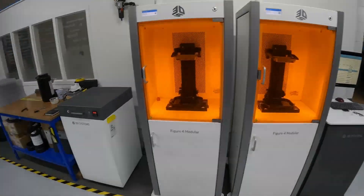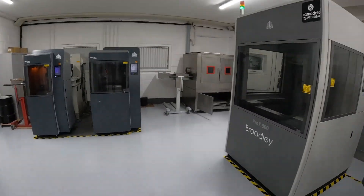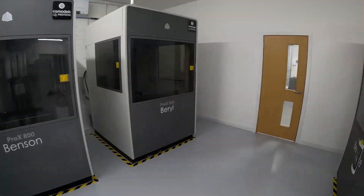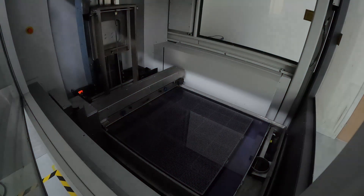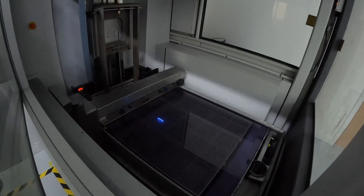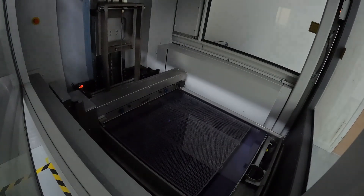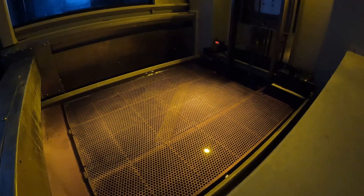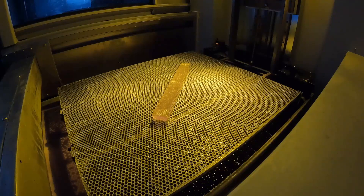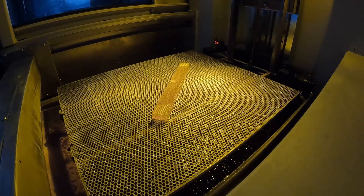I'm lucky enough to work for a company called CE Models, part of ProTotal. This is my department — this is SLA, which is Stereolithography, which uses UV curing lasers. These are all various machines: we've got Pro X800s, iPro 8000s, Pro Jets, and Vipers, and we run various materials in these. From HPC — which is a high performance composite, used by a lot of Formula 1 teams — right through to something like this clear material. This just happened to be running on the day as a wee test piece, so I thought it'd be cool to let you see how the laser works. Basically it's curing the top level of the resin. This one is quick cast, so it would be done for making investment casting patterns — say for making titanium parts or something like that.